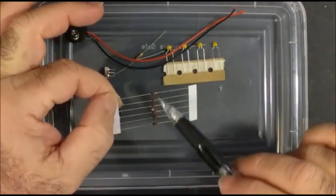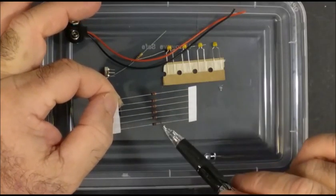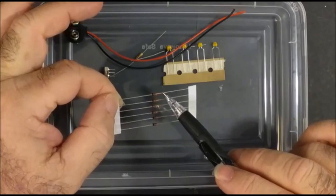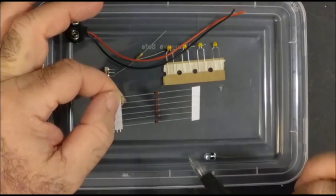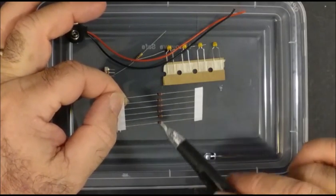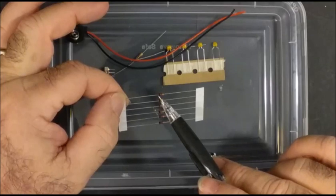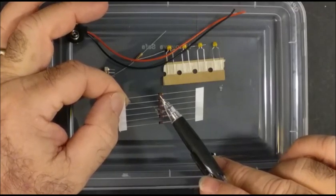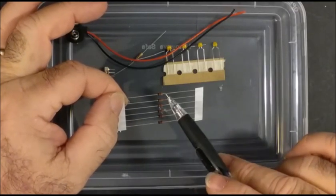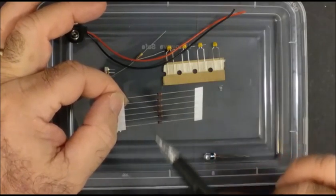There are three different part numbers that would all be acceptable. These are the smaller ones, rated for a half a watt, which means they can handle a half a watt of power. These are Zener diodes — special diodes. On a Zener diode, it works by clamping when it reaches a Zener voltage, and you set these up by being reverse polarized.